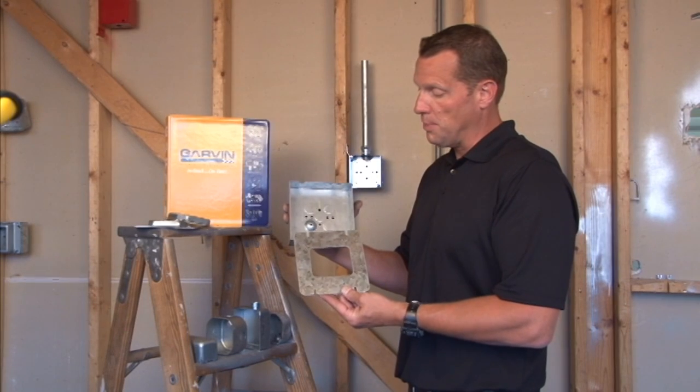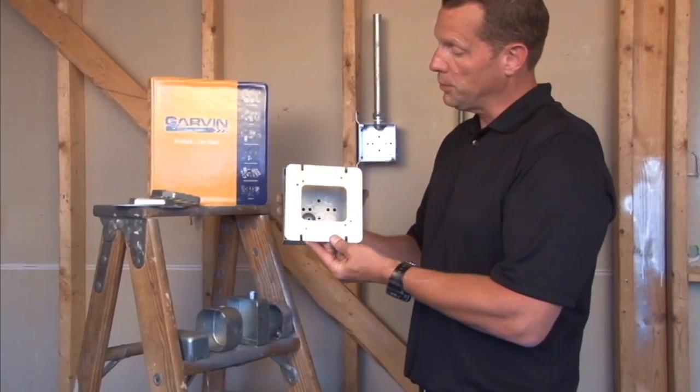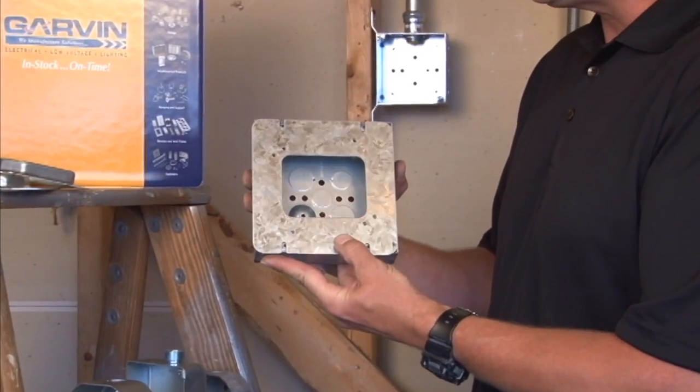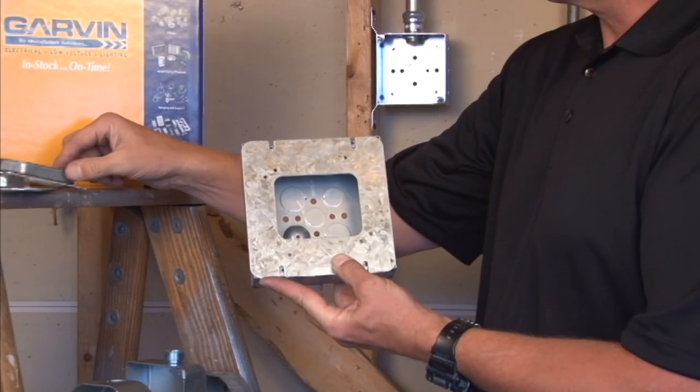This particular model, part number 6CP, is a cover plate that mounts directly on a 6-inch square box and provides a transition point so that standard 4-inch square plaster rings might be added before drywall, tile, or plaster is fastened to the wall.